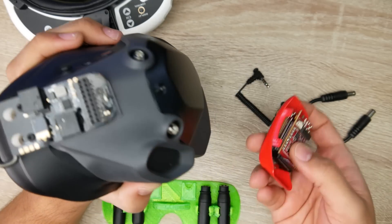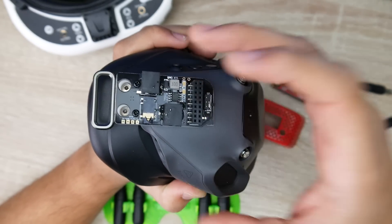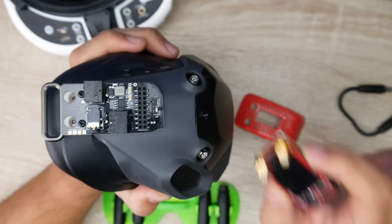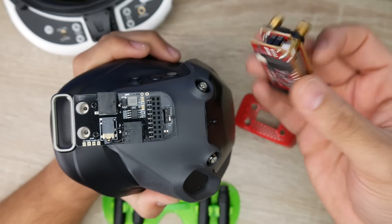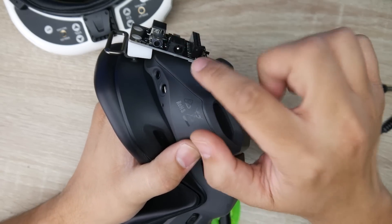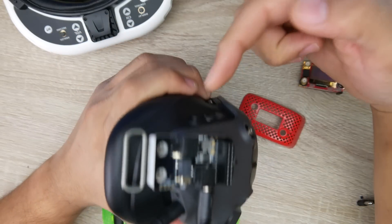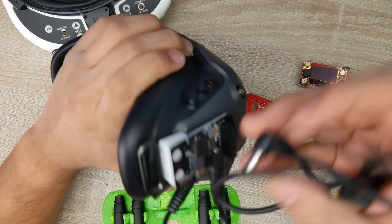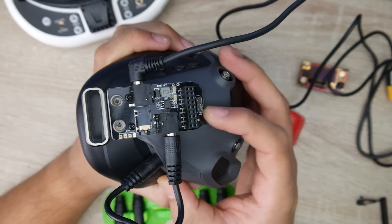These modules cost more than two budget goggles put together, so you have to be careful. That 5-volt switching regulator steps down the voltage from a 4S battery to 5 volts. Clean video feed — there's no noise generated from this circuit, which is really great. There's also another DC jack, and they provide you with a small cable that goes into your goggles' DC input power. All you need to do is plug in your battery, and then you have power for everything, plus full use of the power button.